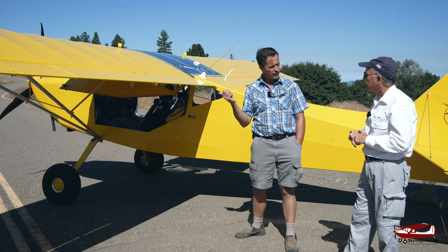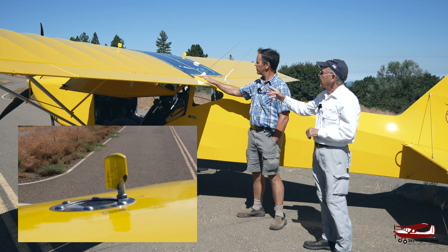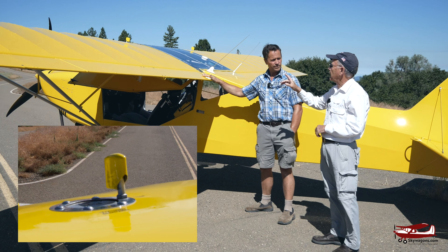The original Ravens would have had manual flaps, like a parking brake lever. On the fuel side, the wing tanks hold 13 gallons on each side. The kit came with a probe with a hole in front to vent the wing tank. What I found was that it would get dirt, bugs, and water in there, so I put a little cap over it that lets air come up through the top of the vent while the dirt and bugs go around it.